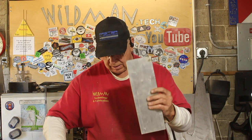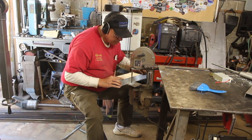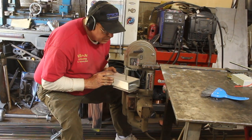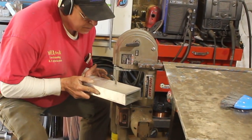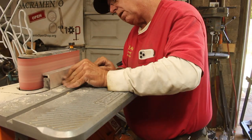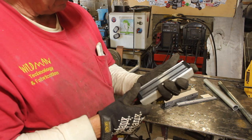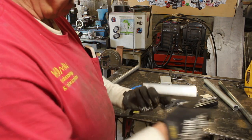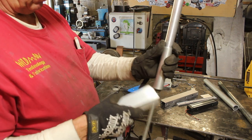We'll make our new magnet holder out of this, then we'll weld this on to it. This is looking pretty good - that fit is pretty nice except this is really hot because I just sanded it for about 20 minutes to make it nice and flat. Now I think I'll drill a hole in this and bolt this on to it, that way I can weld it all together at the same time.